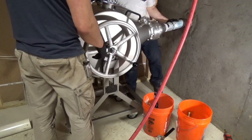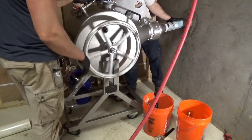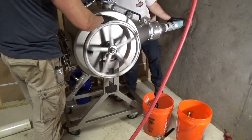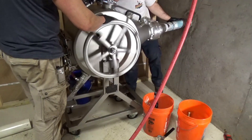Now for the last step of the process, we'll shoot a calibration tube — a third tube — inside of the lining material. This will have 180-degree hot water recirculating through it for the next two hours to harden up that epoxy liner.